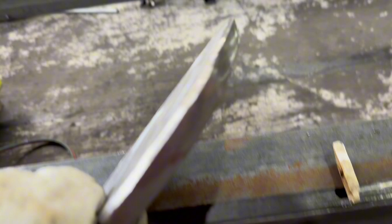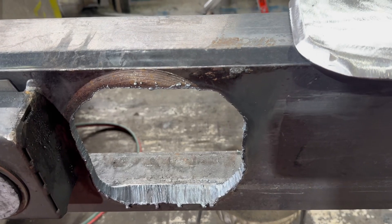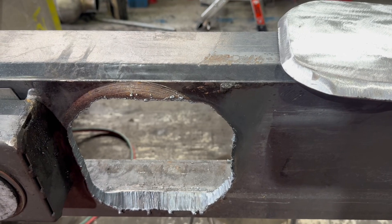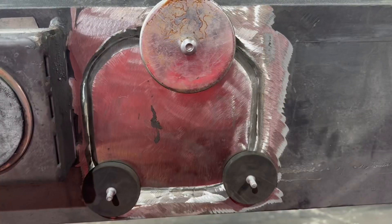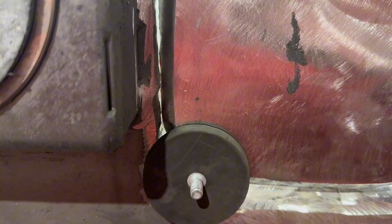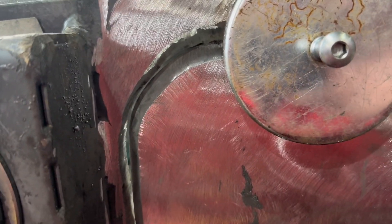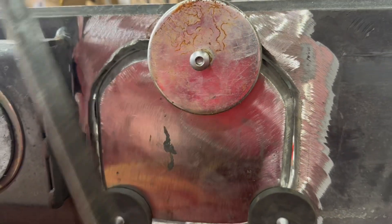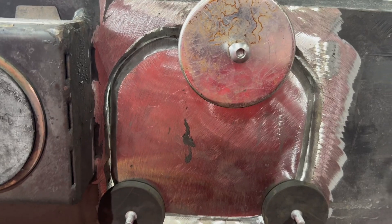We've cut the plate out and done about a 30-degree prep on it with a six-mil back prep — hand cut, basically what we want. I'm going to get the grinder out now and clean that up. As you can see, we've put magnets to hold it firmly in place. You can see slightly where it's touching but we can run the slitting disc in there. We've got a nice couple of mil gap in there to get full penetration through the other side, and the magnets are holding it absolutely true. I'm happy with that.